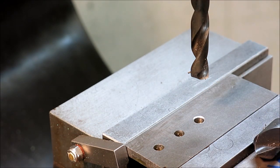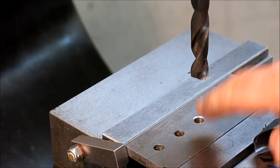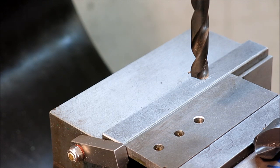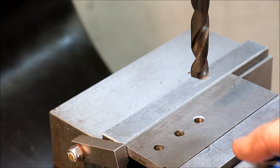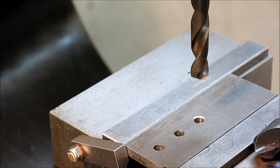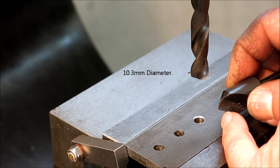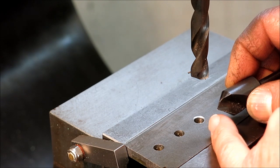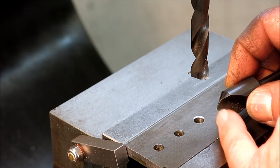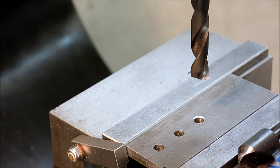You would just come down, and so I said to the foreman, geez, how come you guys don't use countersinks? You get a specific angle, you can get this nice low angle and knock those burrs off. He says, well, there's a good reason, because a lot of the holes that we do are all the same size, and they were 13/32. There were gajillions of 13/32 holes. So his point was that the countersink wears out right where the 13/32 diameter intersects that edge. The rest of this is fine, but right at that particular diameter, it's wasted. And the countersinks are expensive, and they wear out right at that one spot.